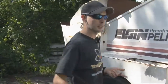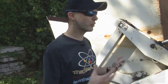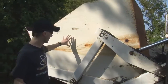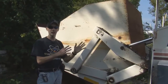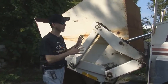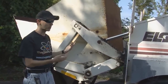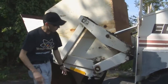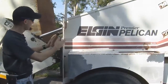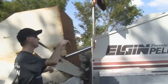So we figured while we were here today, we'd take a minute and share this with the world and give you guys out there that aren't local members just a quick look at the street sweeper. So here's the basics of it. This is the hopper up front, which is way forward. That's because it's been sitting for a while and we can't start it. And without being able to start it, the hydraulic system bleeds out and this thing falls forward over a long period of time. But the hopper, normally this here would be right here, and that'd be at this level in there.